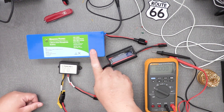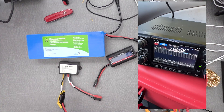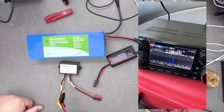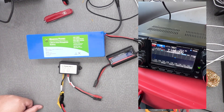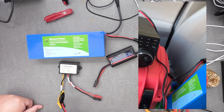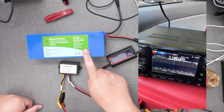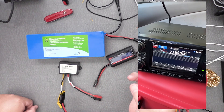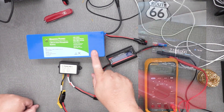I've been using this battery recently on my IC7300 for mobile operations. If you turn the IC7300 on and don't crank the volume all the way up or the screen brightness, you can get about 12 hours because it draws approximately 0.95 amps — very close to one amp per hour. Of course, if you increase the volume, brightness, or transmit, you won't get 12 hours anymore.